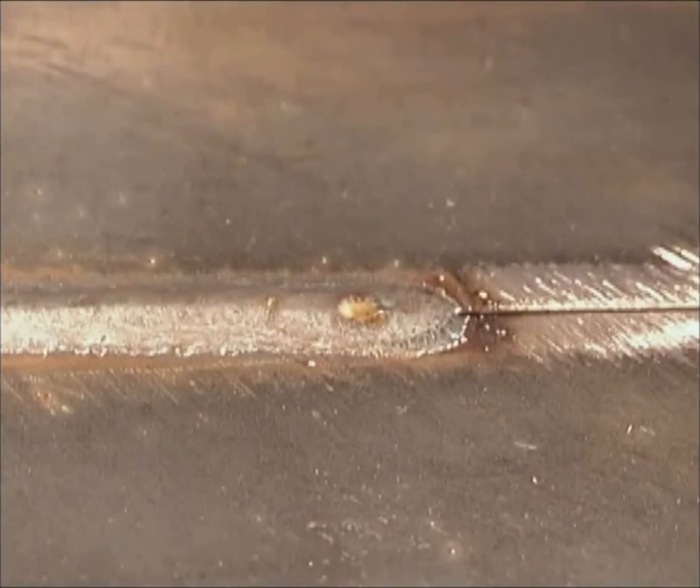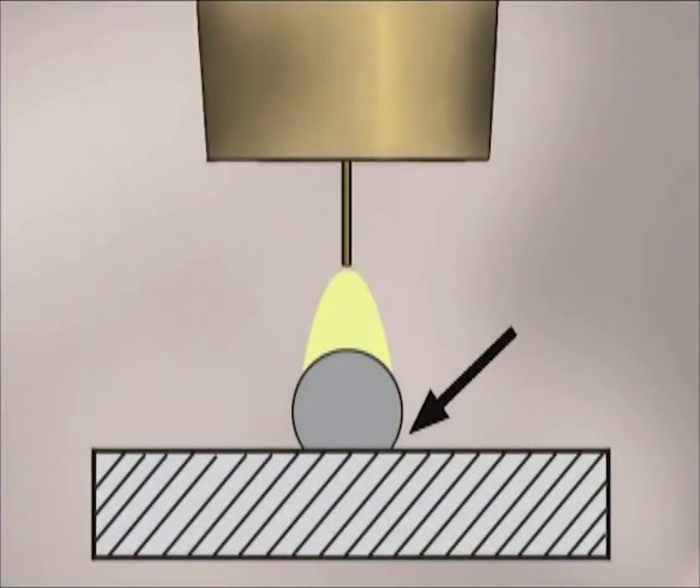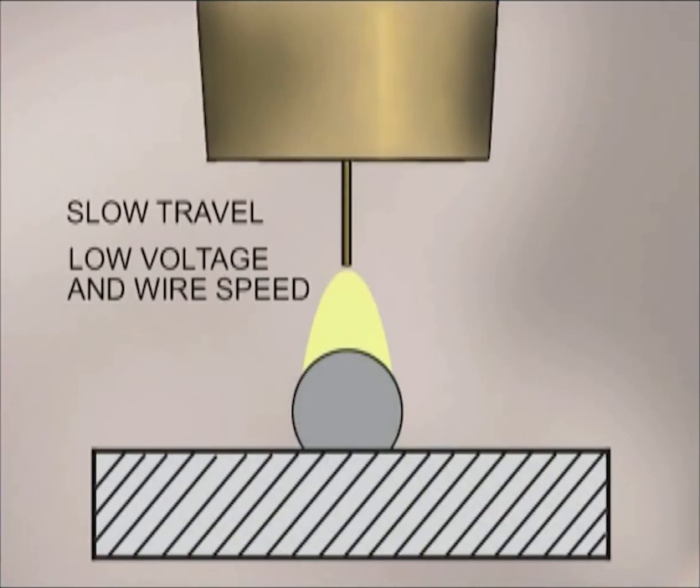One of the biggest problems with gas metal arc welding is running too cold. Welding works best when the machine is set as hot as you can handle it. More heat produces better weld fusion and smoother weld beads. Try setting up on different metal thicknesses, tune the voltage and wire speeds together and make some practice welds. If there is too much metal and you can't stay ahead of the puddle, turn the settings down a little. If you think you can handle a little more heat, turn them up. The final settings are determined by watching the molten puddle during the weld and examining the finished weld bead. If the edges are rolled over, your travel speed may be too slow, along with too low of a voltage and wire speed setting.